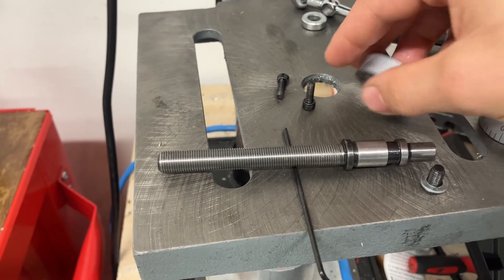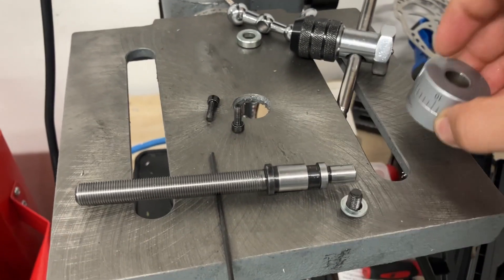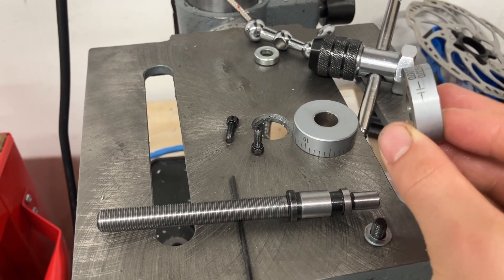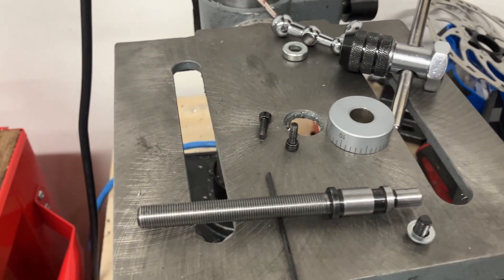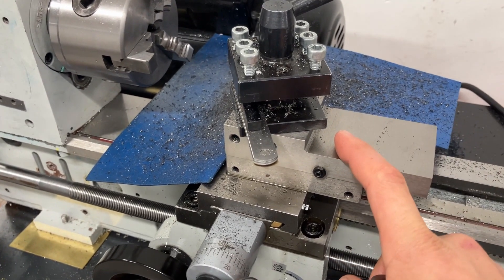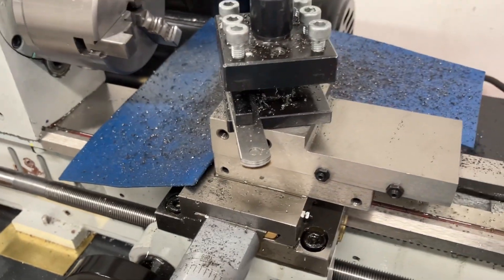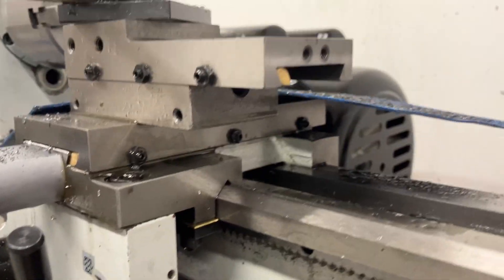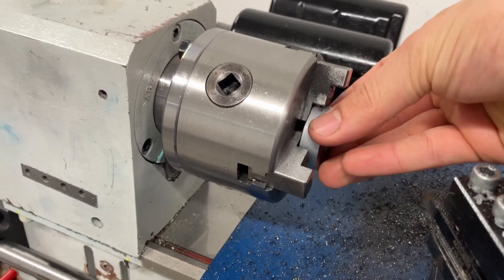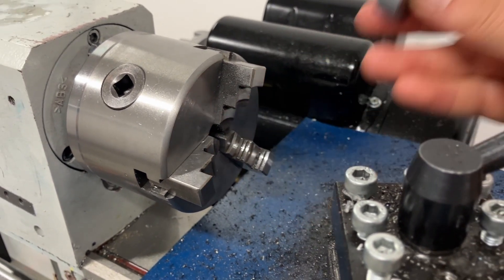So the combination of these two pieces had to shrink by two millimeters. I decided to shave down this side by two millimeters. The way I did that is I put the compound slide in and I locked these in just a little tighter, so this is permanent and can't move. I then just put that in there and turned it down two millimeters, frequently measuring.